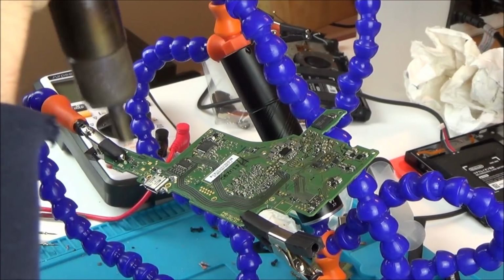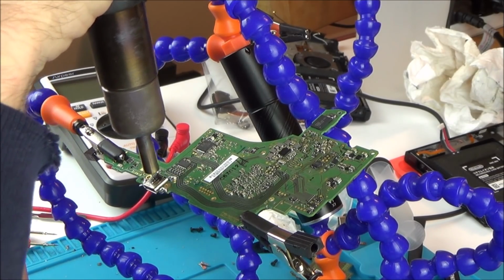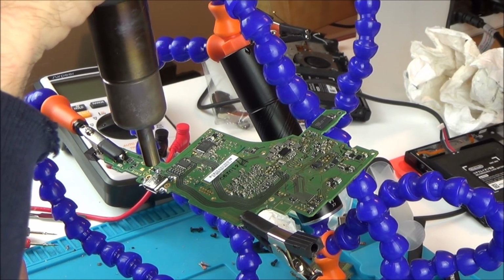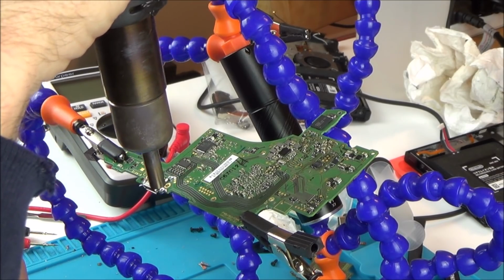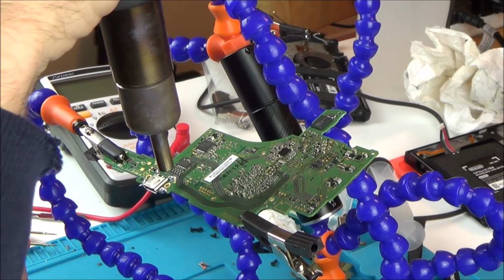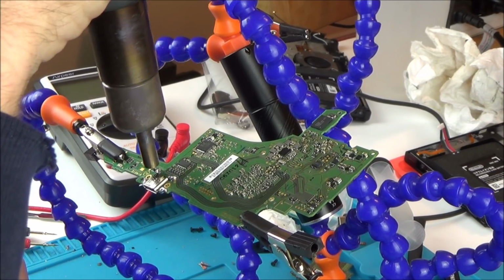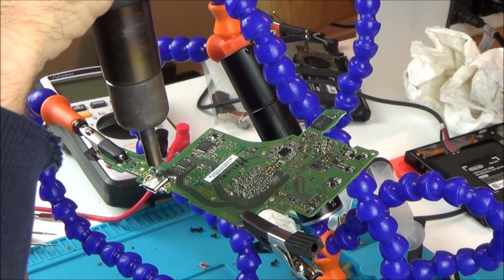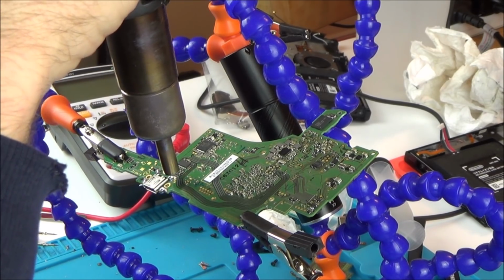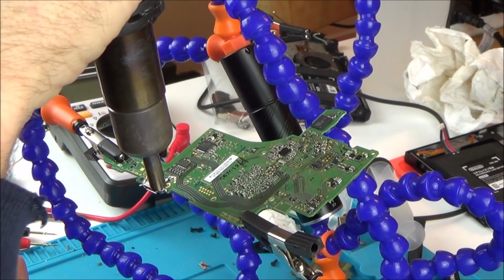Because now we've got the low melt solder on, it should find it a lot easier. Now I didn't put any of the low melt solder on the actual pins themselves. Remember, I can't actually get to one of the rows. But because those pads are quite small, it's the ground pads that are the massive ones, and they seem to take the most heating up because they're big. Alright, so I'm just going to keep moving around here. This will probably take about 2 minutes of heating up.